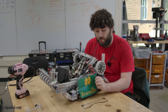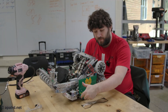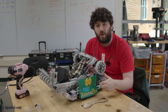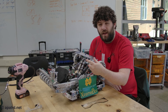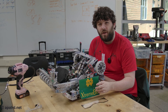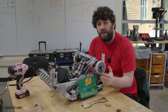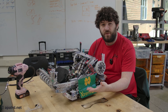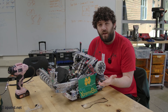Some other laser-cut parts on the robot are these wings — they fold out to push balls and can get easily broken, so they wanted spares. They did a CAD model, sent me the DXF of the flat piece, the laser cut it out and cut all the mounting holes, then they just had to bend it by hand. When you start looking at duplication — making four of them — an extra five minutes per part on the laser is a lot easier than hand laying out, drilling, and cutting. They also have nice graphics, this 'ExtremeBot' was cut on the laser out of laser-safe vinyl, transferred with masking tape, and it looks great.